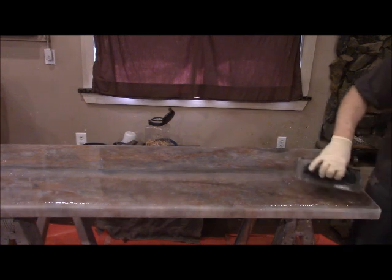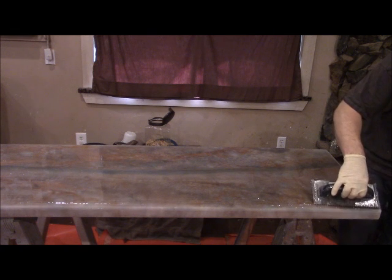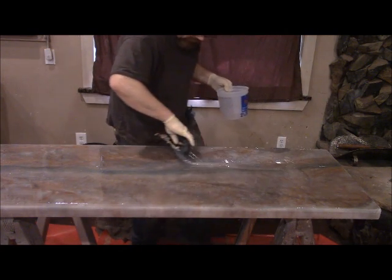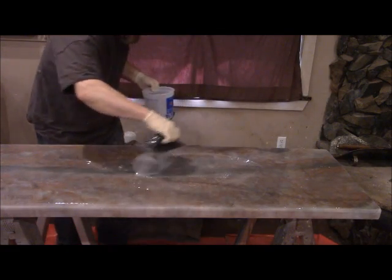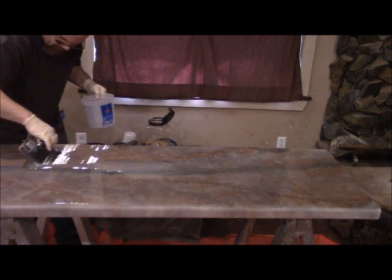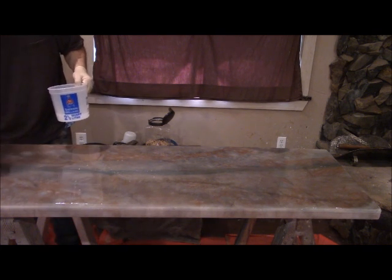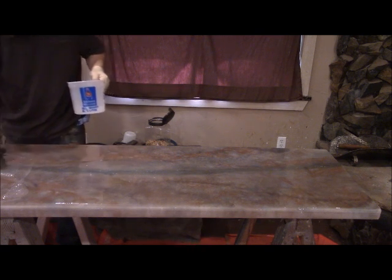I'm just mixing this around, coming right up to the edge but not quite over it yet. I like to put a little bead of material right to the edge, then brush the edges. I'm getting the material spread to where I have an even coat, then I'll take the excess material off the top. All those sanding marks disappear as soon as you re-wet the top with stone coat — you will not see those. The sanding helps it bond to the first coat. When a coat is still tacky, you don't need to sand; but when it's no longer tacky, you need to sand with 220 grit.